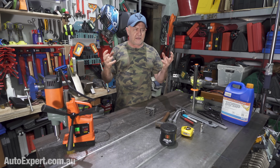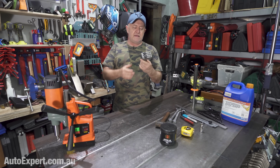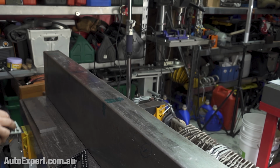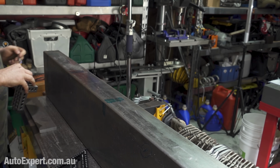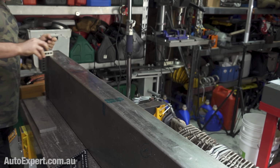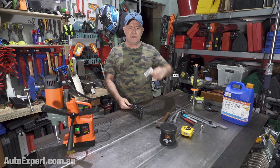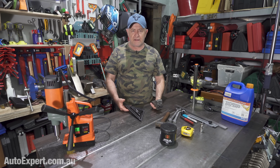It's a shim. It can be used to bolt your 1, 2, 3 blocks together with some of the studs and some of the nuts, and then you get a jig that you can use to mark out the depth of the holes based on the height of this surface. You can go down to the edge of your 1, 2, 3 block here. There's a precision flat square surface to mark out the depth of the hole. And as long as you transfer the sort of longitudinal location of the holes with your trusty speed square, then that's all you need to get the holes to line up. Because once you've got them in the right position this way, and once you've got them in the right position that way, they don't have any alternative but to line up.